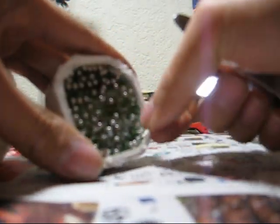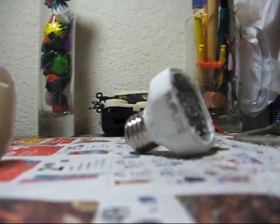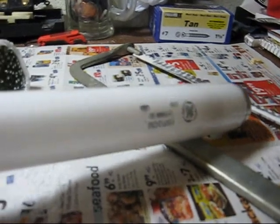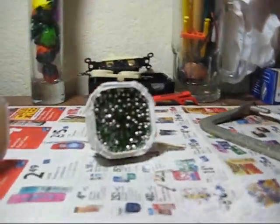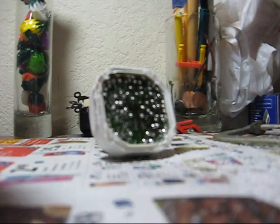Here are the wires that would connect to the bulb. You can actually run a full-size linear fluorescent bulb with this — I've done it before with a brand new bulb, which I've also dissected. If you want to test this, you can hook it up to a 20-watt fluorescent bulb. Here's the bulb part itself — four wires, two going to each electrode.